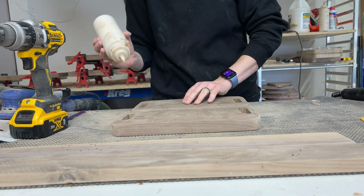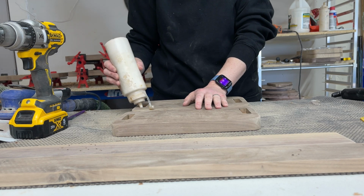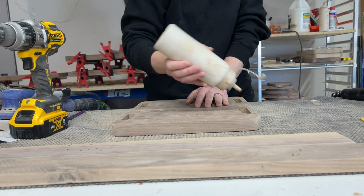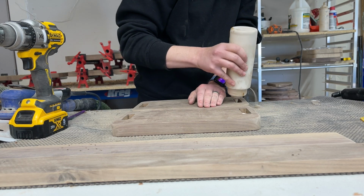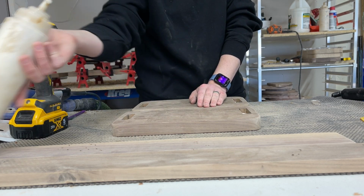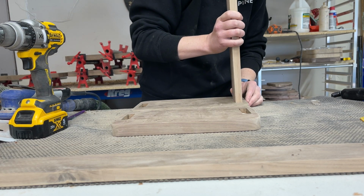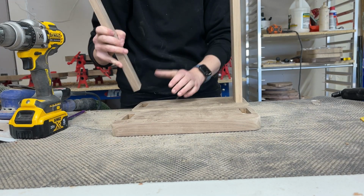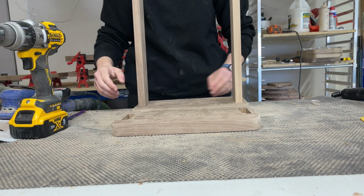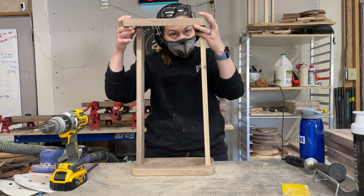You can buy the Miller dowel kit in the link that we have provided to our Amazon storefront. Make sure you dry fit before adding any wood glue, and then you'll add wood glue to each part of the cutout and to the bottom of the legs, and carefully assemble the table into shape, using clamps if necessary to create a tighter fit. Whether you're using the rectangular legs or the dowel legs, cut your legs to the correct height and then assemble carefully.